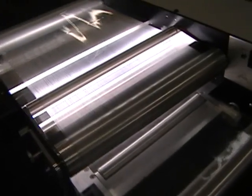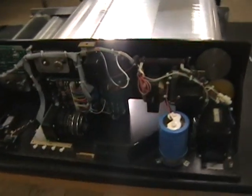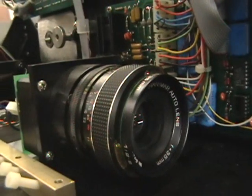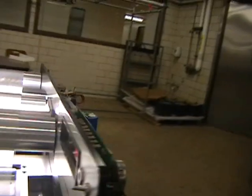In order to obtain a measurement, the leaf is placed on the transparent belt and travels under a fluorescent light tube. If we remove the back cover, you can see the series of 3 mirrors that reflect the leaf projection. The third mirror reflects the leaf image to a linear array solid-state camera. The camera senses the object width and length. The main circuit board then calculates the total area. As the sample passes under the light, the leaf area is shown on the LED display.